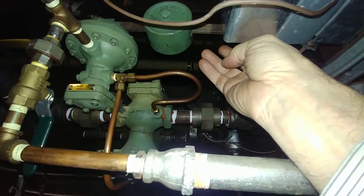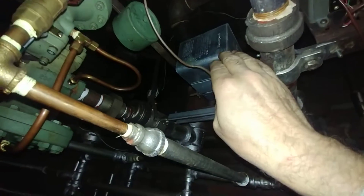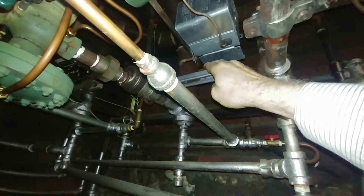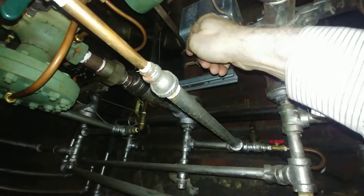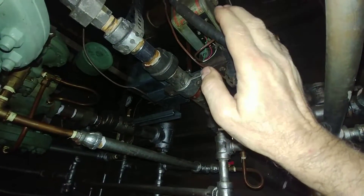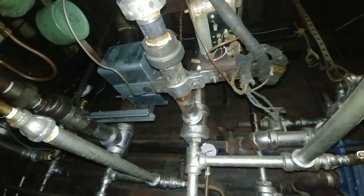We replaced this motor control here. It is normally closed — when you energize it, it ramps up, and when you de-energize it, the spring returns it. This control here is a three-wire control and will need to be powered open and powered closed.